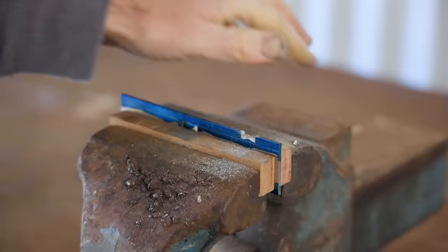Before I start putting it together, I'll anneal the brass dovetails by heating them to an orange and holding each tail at that temperature for around a minute each. When they cool down, they'll be softer and they'll peen better with less chance of cracking. I did quite a few tests with different methods of annealing before jumping straight in, and this had the best results. Here's a piece that cracked and wasn't annealed, and here's a piece that was annealed.